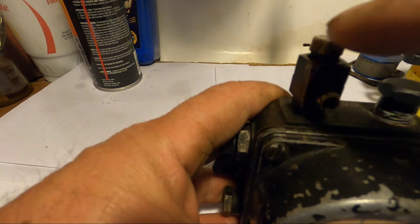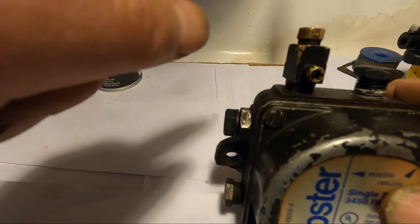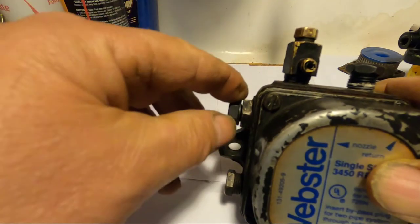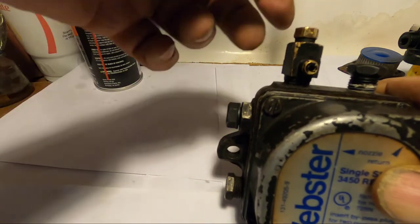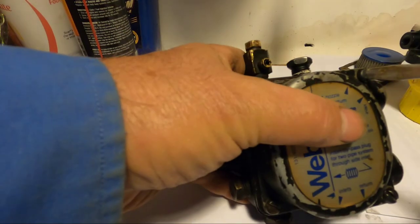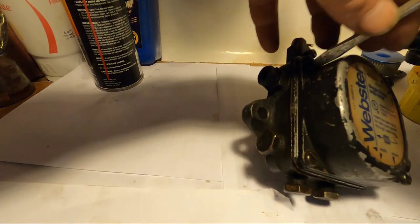This valve up here is the bleed valve, which when they installed this, they did it incorrectly because the feed tube comes out this way, comes over, and goes into the boiler right above this. So there was never a way to bleed this. When I used to have to bleed it, I used to bleed it from the feed tube. I would just turn it around and bleed it into a hose. So that's corrected now that I have this other one installed. Let's get into this. These screws are loose because I've been in here before. When you first open it, they are tight.